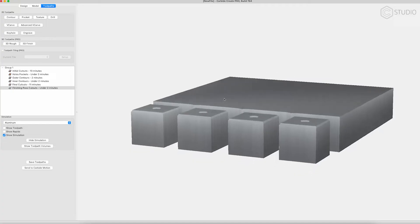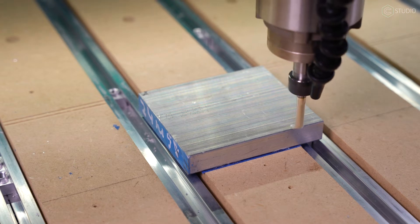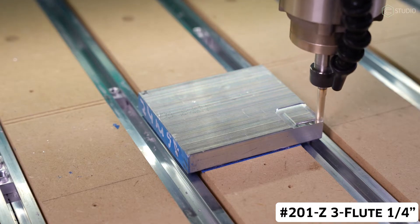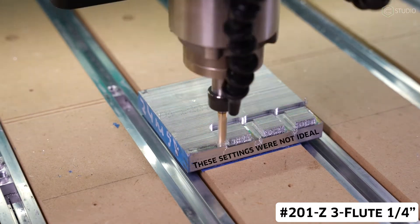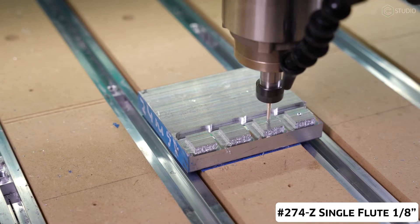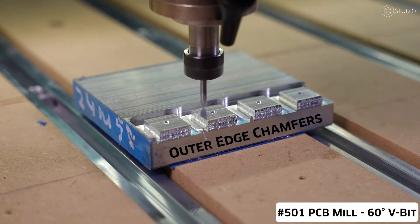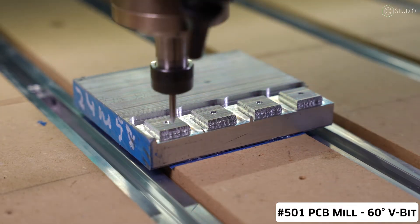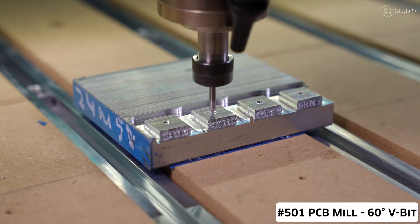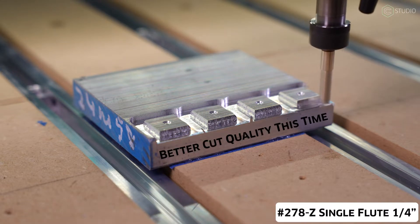You're going to have to set up one tool path group for each side — it was a lot of copy and paste. I would copy the tool paths, then edit the vectors to which they apply, for both the actual number marks and the chamfers inside, so you can activate or deactivate whichever number you're running over in the MDF pockets. With my first pass at tool pathing complete, I'm ready to run version one. That's how I roll — I go cut so I can learn.